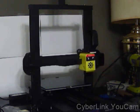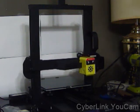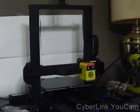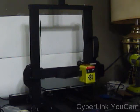At each auxiliary leveling point, adjust the horizontal height between the print head and the platform by rotating the four nuts under the printing platform. Adjust the printing platform to keep a distance of 0 to 0.1 millimeter from the print head as shown in figure 1-3. So it is shown in the box.